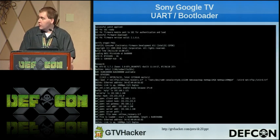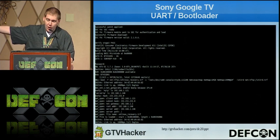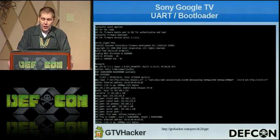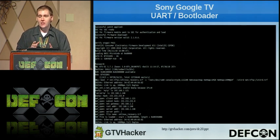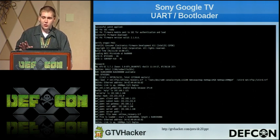We could reload it. So this picture shows the initial boot up, shows us entering a password, and then we boot over the network to a TFTP server, the exploitable recovery version and initial RAM disk. It takes a few minutes, but then it will drop us to a root shell, which is perfect for what we needed. And it gets even better since, when you boot via TFTP, the system doesn't unlock the ATA, the SSD on board. The kernel panics and drops to a shell. We don't even have to do anything past that, which is awesome.